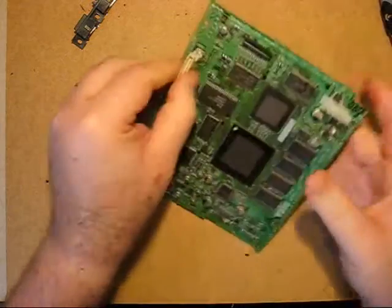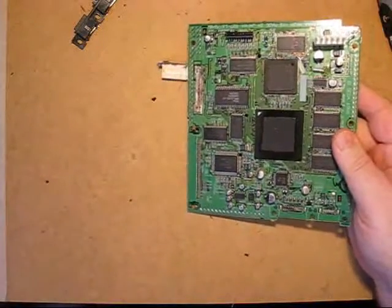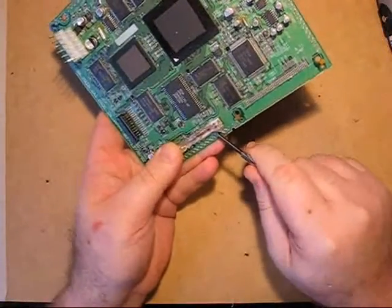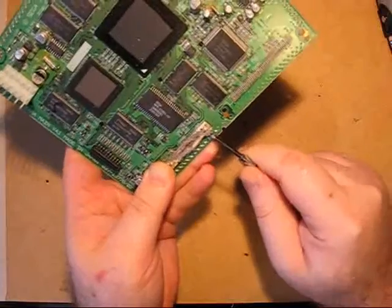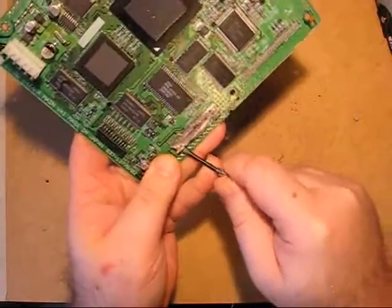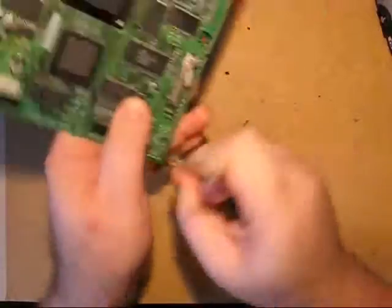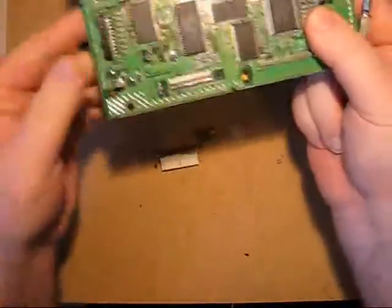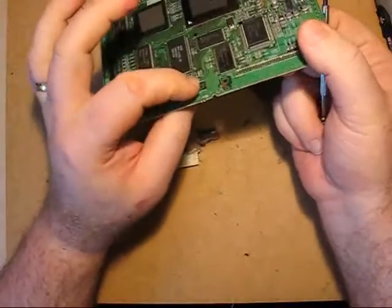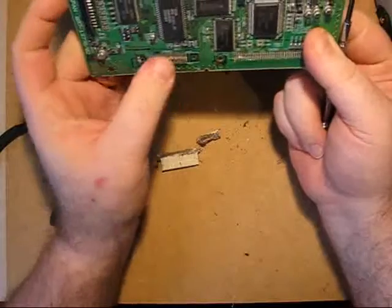If it flips, it's either going to hurt the board or it's going to fly through your fingers. Let's see what we have now. Wiggle this off — we have a little bit of melted plastic onto the pins; this is where the screwdrivers come in to use. Be careful not to damage any parts of the board, but if you put a little bit of pressure underneath — not much — you should find the part lifts. If you need to use too much force, you need to remove a bit more plastic from the old plug. Just lift a little bit here, a little bit there, and you'll expose the pins — none of them will come off.